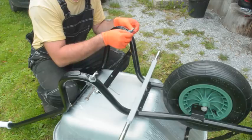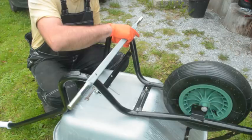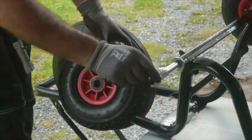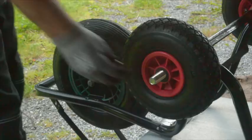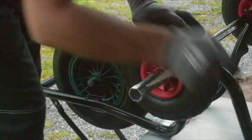The purpose of this epoxy putty is twofold. First, it fills the gap between the square tube frame and the square axle — so if there ever develops a little play or movement, the epoxy putty will keep everything nice and tight and rigid. The other thing is it keeps water out of the bolt hole so it can't cause rust in the tube frame. I've then painted the whole lot with Hammerite — it's a rubberized paint. Make sure it spins freely.